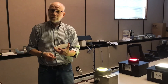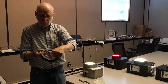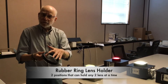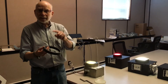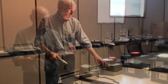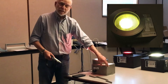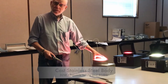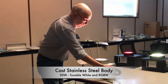We're shining the light against the wall but not into the eyes of somebody standing nearby. The rubber ring lens holder has two separate positions, so I can put in a color filter, a diffusing lens, a honeycomb louver, or a linear spread lens — any two at the same time. We put an arrow on the body showing which face is the wall. This is cast stainless steel, very heavy-duty, 30 watts.